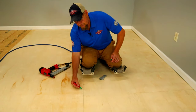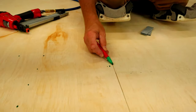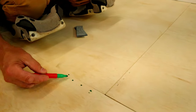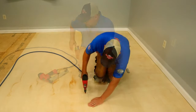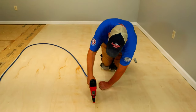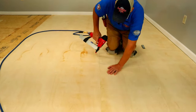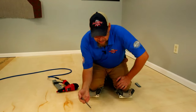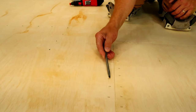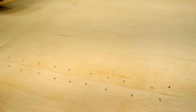Keep your staples about a half inch away from the actual edge itself. Here's the staple — it's going to be about a half inch from the edge of the plywood, about every two inches. I'm going to do a few staples right there so you can see exactly what I'm talking about. Notice I left my staples about a half inch from the edge of the board, about every two inches on the seam.